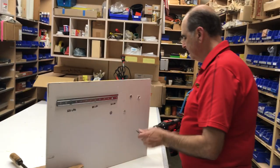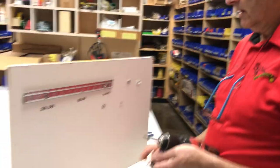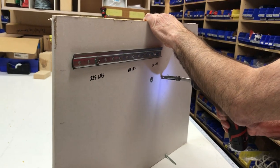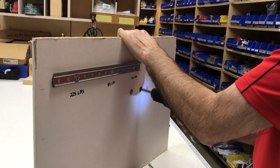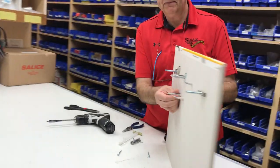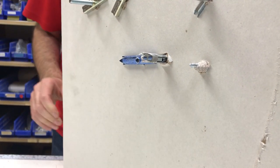The second anchor is basically the same one, and this requires a machine screw. This one also gets screwed in. Be careful — it's a little flimsy — but you put that in like that. Stephen, if you can look at the camera in the back, you can watch and see what it looks like. You can see it comes out, that thing is going to flip around and clamp onto the wood. I'll show you by putting the screw in and coming to the other side.